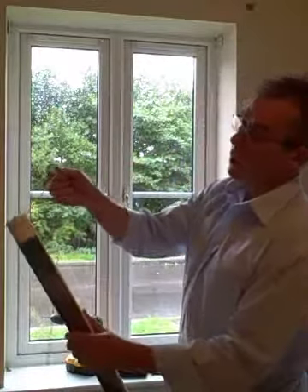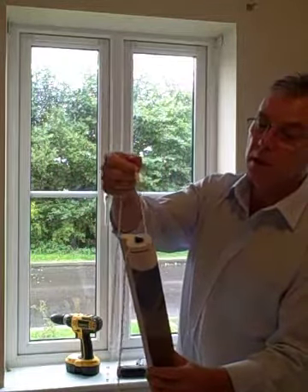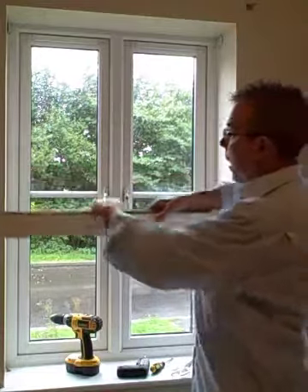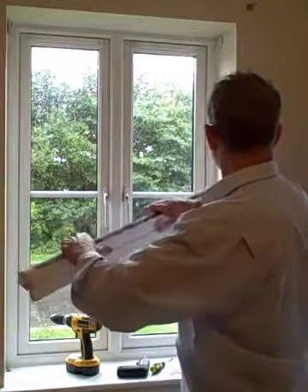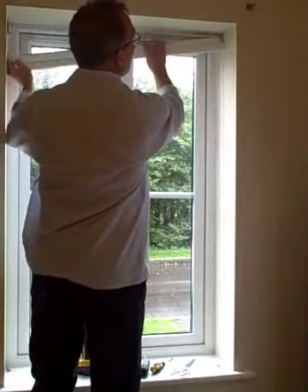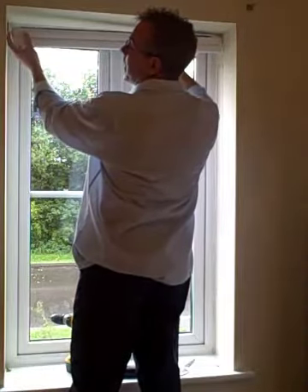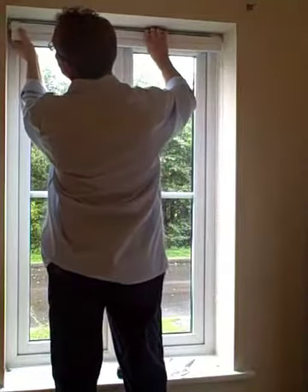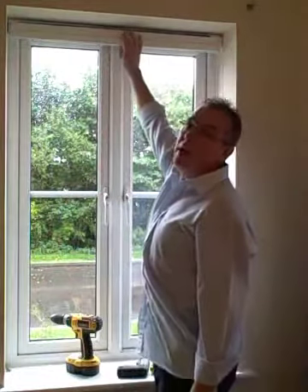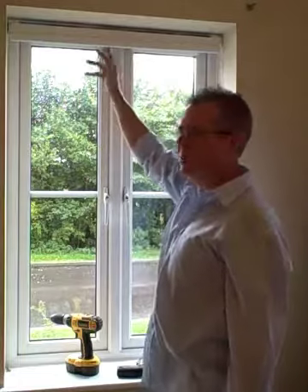The child safety portion of the chain — the part that gives way under tension — needs to be at the front of the blind towards the top. Get up to the level of the blind, put the blue hook and tab into the bracket, then with the other end depress the spring plunger with your finger and push it into the bracket until it locates in the hole. The blind may not be totally taut at first, so just pull it down to take any looseness out.